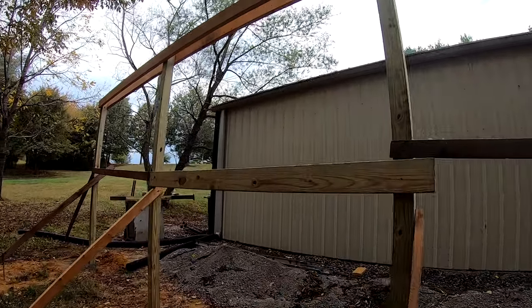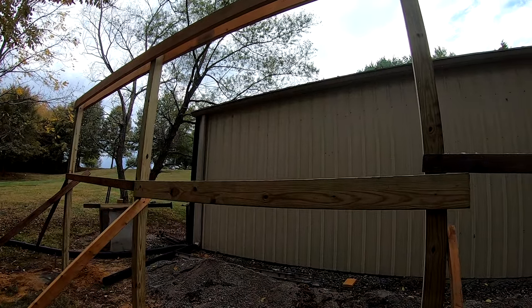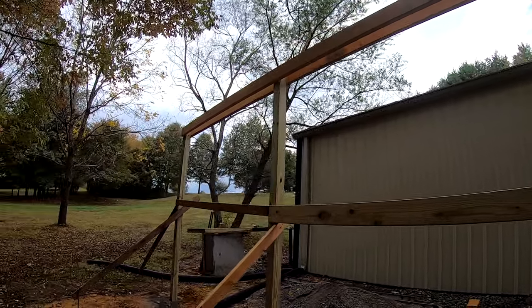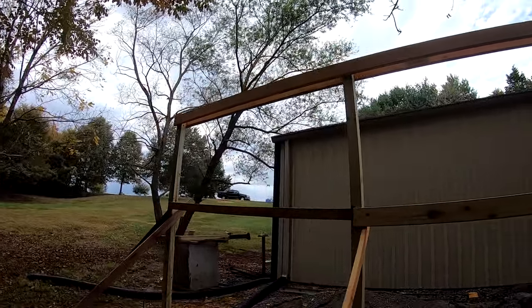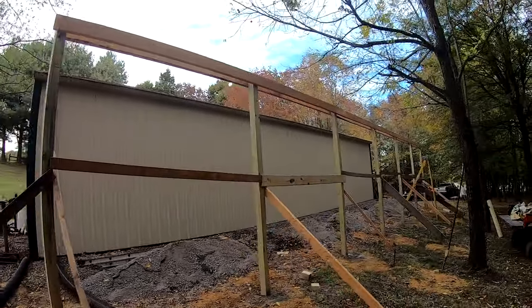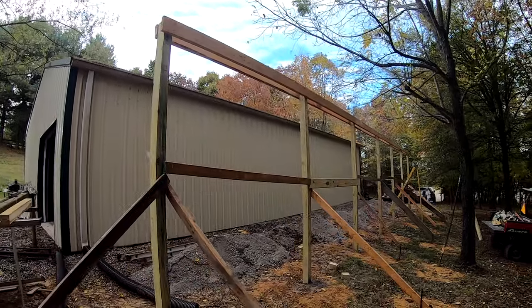And then on that we'll do a joist hanger or rafter hanger, whatever you wanna say, and come off that and land the rafter on top of these. Maybe do a little bird's mouth so they land on there flat. Tack those in with a little steel plate and throw some purlins on it, and sheeting.